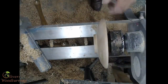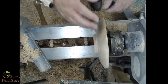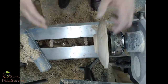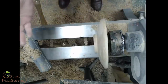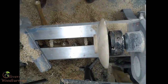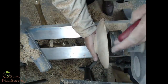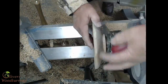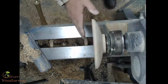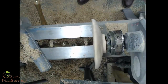But I find that if you're cutting with a sharp gouge and light cuts, you can cut in either direction. So you just cut, and I prefer to cut inwards, which is technically wrong, but you know, it works for me, so I'm quite happy. If I get torn grain, badly torn grain, that I can't tidy up with a fine cut, then what I'll do is cut the other way. Elm, wild grain woods are really notoriously bad for cutting. You've got to cut in a particular way.